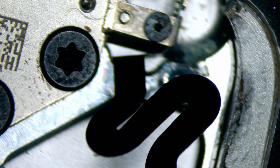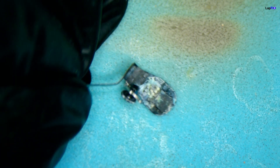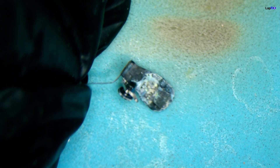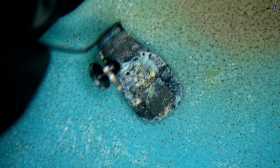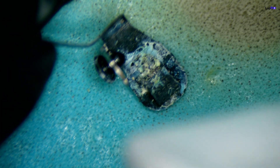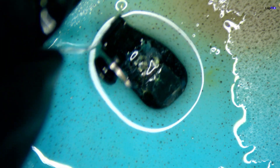You can see this — this is corroded here. So there was obviously a liquid spill and it did cause this problem. It did corrupt that T2 area. Here it is — this is very corroded, you can tell. For something like this, we can probably just do a replacement because the caps and everything look pretty bad in there. We would definitely want to do a replacement for that chip. Most likely that corrosion did cause the issue as well. So the repair will be completed.